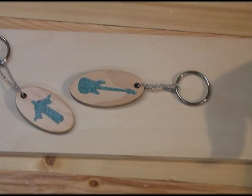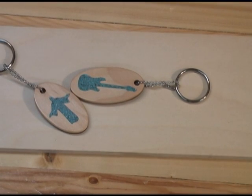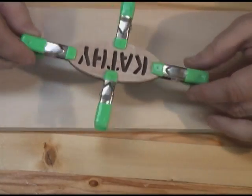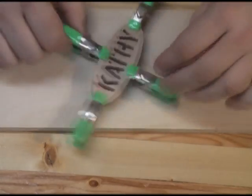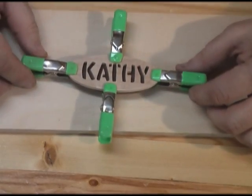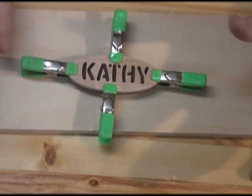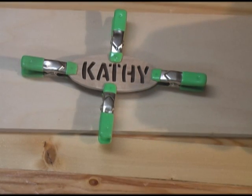It really looks good and I think you guys will be too, because they are a little bit unique. I'll have the pattern book available on my site — at first only the generic patterns, but I'm working towards getting ones with names and I'll get that out as soon as I can. This is the one we're going to be working on tonight. I've got it cut out and laminated together and clamped up to dry — this is my sister-in-law's name. After you get it cut out and laminated, you need to sand everything flush and make it look nice before doing the inlay.